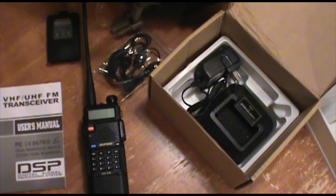Why would you need this versus one of the Motorola Talkabouts? Well, I have the Motorola Talkabouts — a nice upper-end pair, I think the 355s in camo — and they stay at my deer lease cabin. When we get up to the cabin, we plug them in to keep them charged. They're rated at 35 miles, which really translates to about one mile, maybe two. They talk on the FRS and GMRS bands. GMRS goes a little farther than FRS, but you're supposed to only use GMRS if you have a license. The family radios — realistically, everybody uses those channels and nobody really cares.